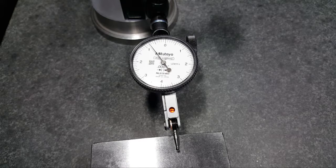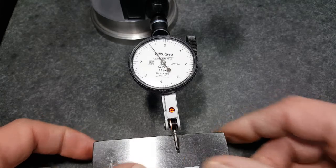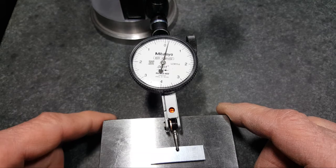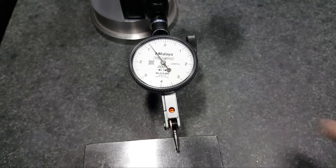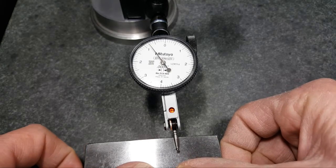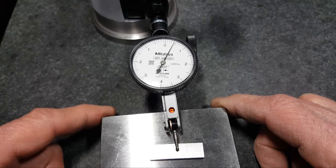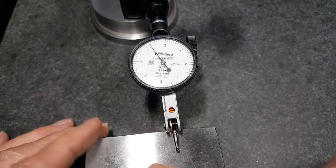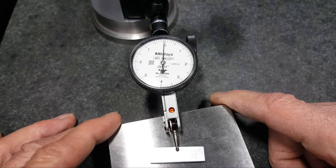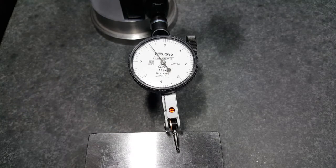Let me try the 0.1002. For an economy grade B AS2 set for 90 bucks, this is pretty good — it should go up to two tenths, and it's very close. Every one of them is coming out just slightly under. Let's try the 0.1005 — this should go up a half, and it's just under. Temperature can be affecting this — it's very cold in the shop right now. Going back to the 0.1 to check — it shifted a bit because of this arm. I'm pretty sure these blocks are really pretty much right on the money.